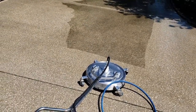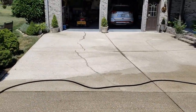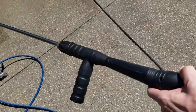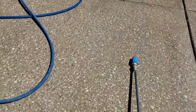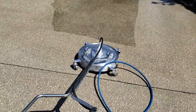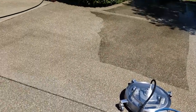Surface washing is for a pressure washing job. I'll show you a little bit really quick — make this a short video. This is my turbo nozzle, and I take this and I edge everything out, I outline everything with it, and where this surface washer can't get — which really isn't much — it's just a couple of inches around the edge.